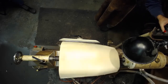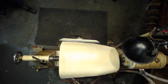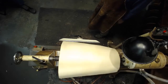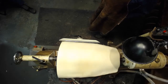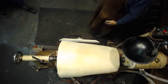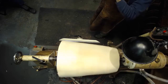No, it's pretty close grain. It has the reputation for being very soft. I would say it's about the same hardness as white birch. Certainly harder than pine or something like that. But as hardwoods go, it's a relatively soft one. For lampshades, it's not easier or harder to work with than other types of wood. I just use it for the result of the translucency. And I'm always working with wet wood, so it's relatively easy to carve away the wood.